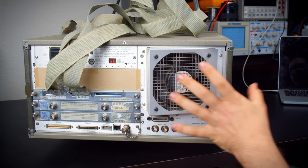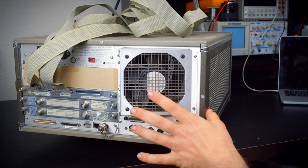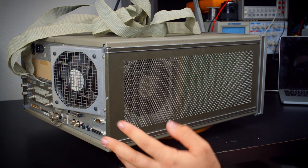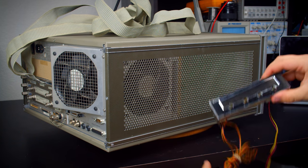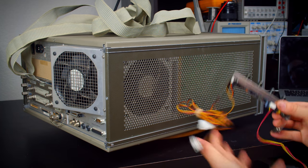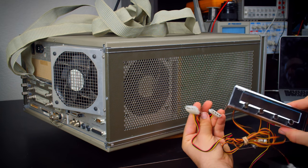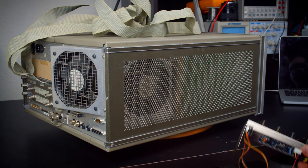And like I was saying, I already looked at the data sheet on these. So the markings for the voltage on these are rather ambiguous on the stickers, but they accept a range of voltage inputs from 9 to 15 volts. And it looks like the standard operating voltage is 12 volts, but that's not really going to matter for me because I'm going to be using this, which if you watched my server build video a long time ago, you may remember I pulled out of my server chassis. This is a fan controller. Now it has all sorts of inputs and outputs for fan power, and I can connect this to power off of the hard drive, which will give me 12 volts, and then I can connect the fans I'm going to put into it in there.